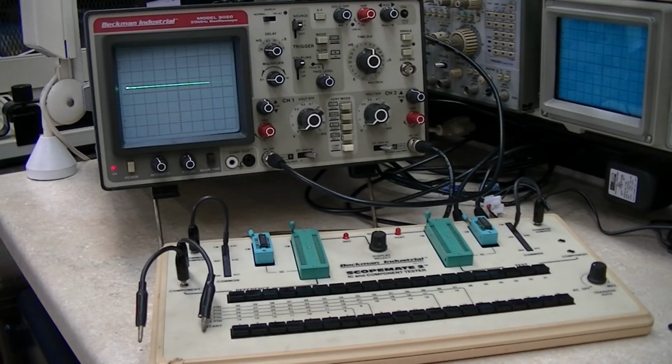And this is probably one of the best ways to do that, because I did notice as I was going along there with my multimeter looking at diode drops, the inputs and outputs still look the same as what the good one does, but that IC is totally dead. And this is kind of a good method. You put that on the ground side, and everything somehow, somewhere, eventually references to ground. So if nothing does reference to ground, then that IC is no good.